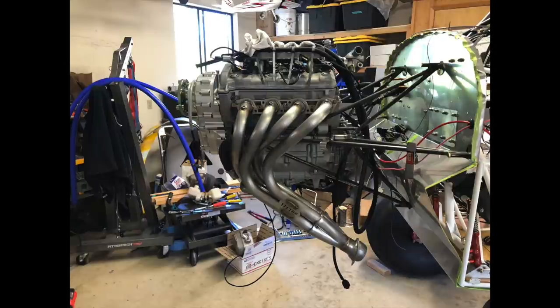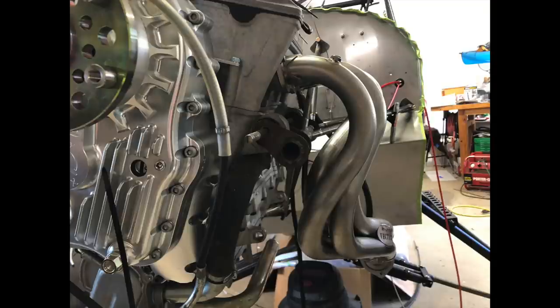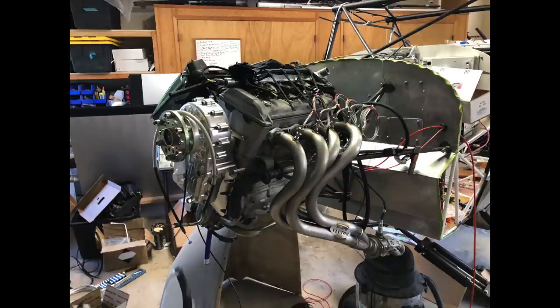Furthermore, the design in itself — if you go back to the motorcycle design — is really designed for 200 horsepower. There are different parts on this engine, and the horsepower output from the original RX1 is about 140 to 150 horsepower. But the capability of boosting it up to 200 horsepower and remaining inside the original design of the motorcycle engine also made it another key feature. We could boost the power and not exceed the design. With the application of a turbo, it is possible to boost this engine up to as much as 400 horsepower in sled applications. We haven't seen that yet in an airplane application, but there has been upwards of 300 horsepower put through this engine, so the potential is there.